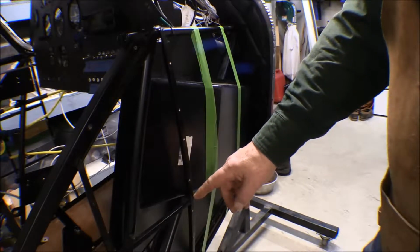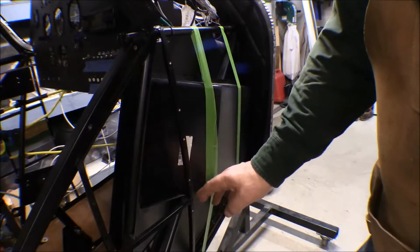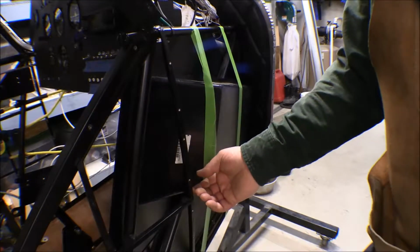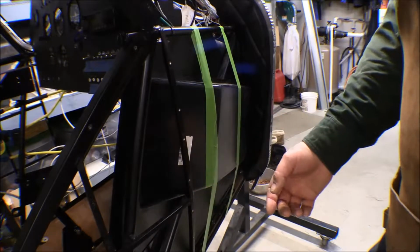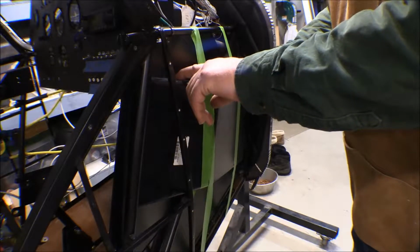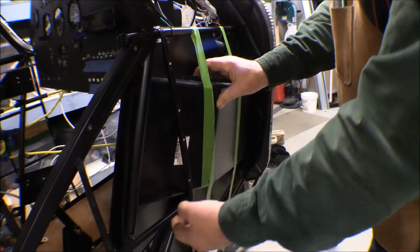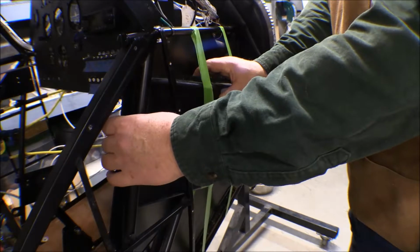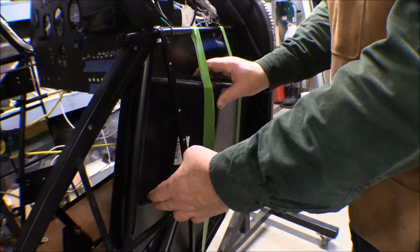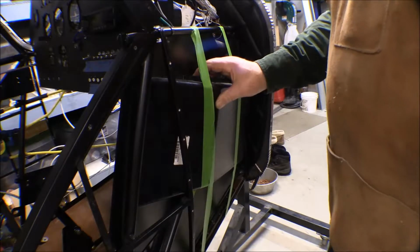And then there's a piece of Piper channel that runs from this rear boot cowl Piper channel and down to that diagonal. So I've got this thing, I don't want it to rub on that either, so it's up a little higher than I would like it, but that's where it's going to be. I'm going to go ahead and drill through this and through this interior panel, and I'm going to put nut plates on this flange. There's a little flange around the perimeter of this, top and bottom, and then the entryway here. And that had Tinnerman nuts for sheet metal screws in there before, but I think I'm going to go ahead and drill these out and put number 6 nut plates in there.